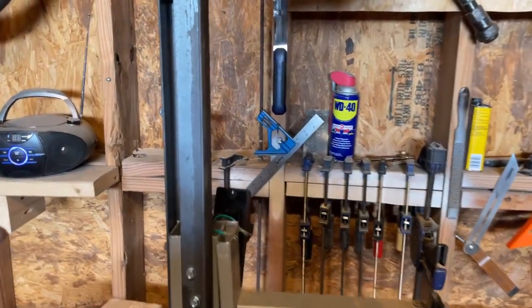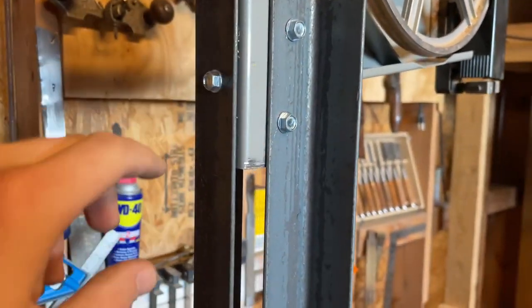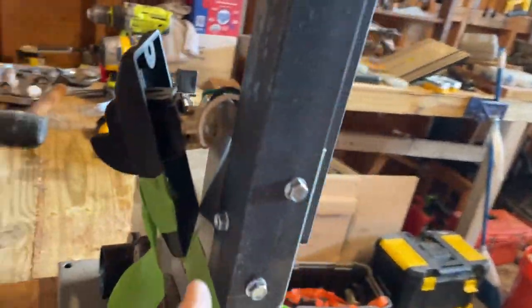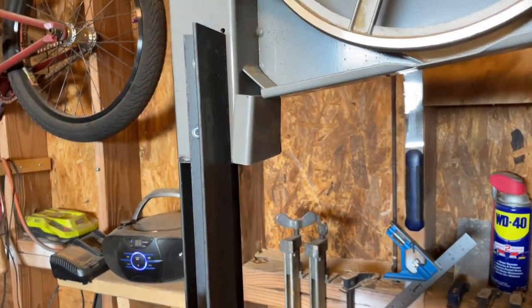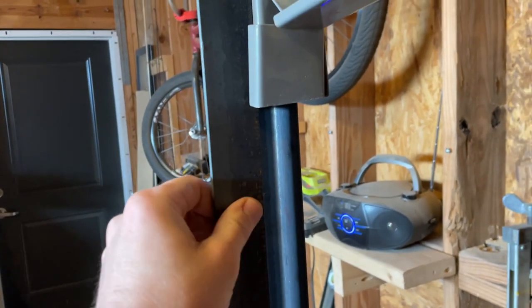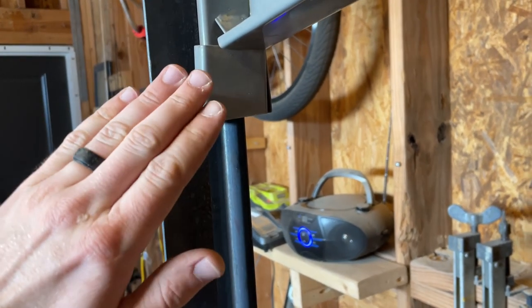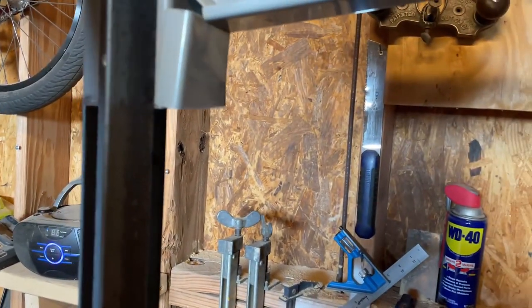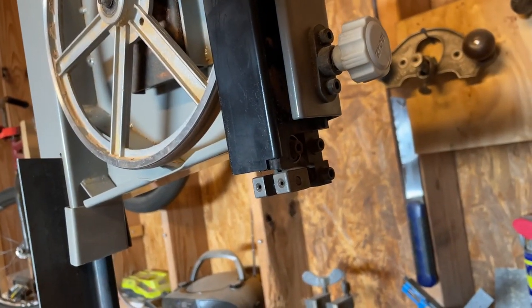All right, so I just put the steel on. I just put these self-tapping screws in here, there, back there, and right there. This one is just my cutoff. I didn't want to cut another piece off, and I felt like having this here also helps add rigidity, because you have material this way so it can't flex on itself. It's pretty rigid though. I mean, it's not moving.